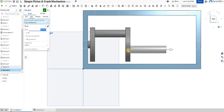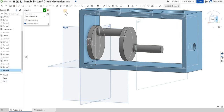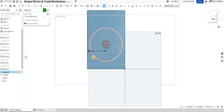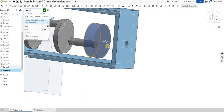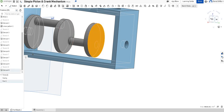We can finish that sketch, extrude selecting the circle, and looking at it from the right-hand side again — we want it 10mm shy of that line, so roughly 75 minus 10 gives us 65mm. Confirm that. Draw a new circle on the end, look at it from the back — dimension it: 40mm from this edge, 50mm from the bottom, size 70mm diameter. Extrude it, selecting sketch 9 at 10 millimeters thick.